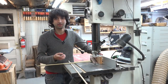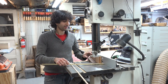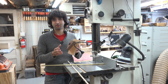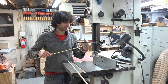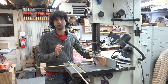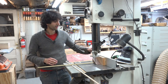First I wanted to show you how I cut this brass rod into the actual pegs that will go into the tenons in the crib to hold those rails in. To cut them to the right length I have a really simple jig here. This is an off-cut from when I cut the taper on the leg, so I have the actual thickness of the stock and I know exactly how long this rod needs to be. I just glued this piece on the side as a stop so when I insert the rod I know exactly how long it has to be. I set the fence so I had just a little bit of clearance between the blade and the block — a little bit of material to remove on the brass when I went to clean it up. This actually went really easily and cuts really quick.